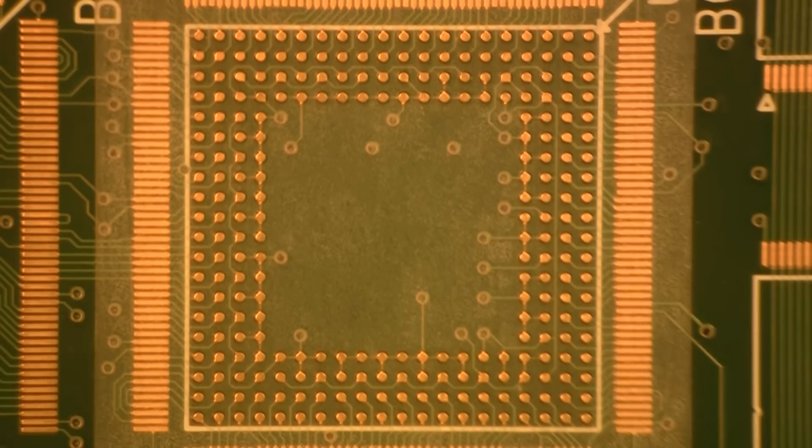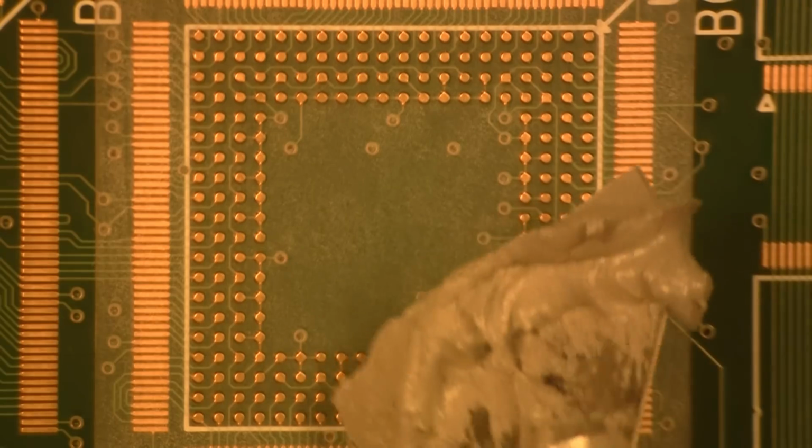Okay, so the next thing I'm going to do is grab my lead-free solder paste. Now, one thing you want to know about lead-free solder paste or any paste when you're doing something like this, we have found out here that if you keep it cold and bring it straight out and stencil it, you won't have any slumping going on, and it'll be nice, even distribution. So here we go. Okay, I have a generous amount here.